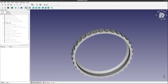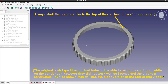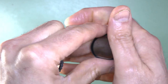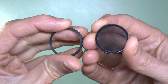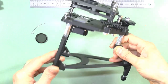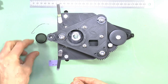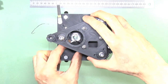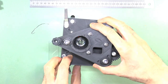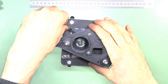To remedy this situation, I developed a new module: the UberPOL. The UberPOL is a simple ring that is quick and easy to print. Once printed and cleaned up, you cut a disc of linear polarizing plastic and glue it to the UberPOL ring as shown. You should use the thinner polarizing film so it won't cause too much extra height to the top of the condenser when used. To use the UberPOL, simply put it over the top of the condenser so it sits between the condenser and the underside of the specimen slide. Use a hook implement, such as a bent paperclip, to rotate the UberPOL polarizer.